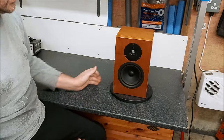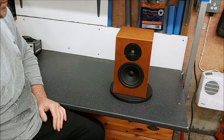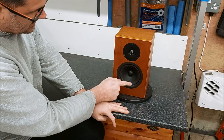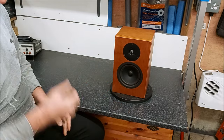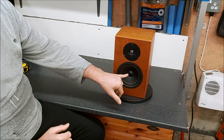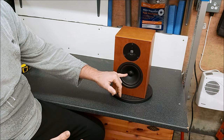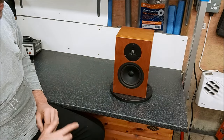This is the one with the tweeter issue — there's a big dent in it. You can see in the response we dip and peak and come down, and there's distortion there. Something's not right with the tweeter. Again with the woofer, this one isn't too bad; you can just see the dirt that's in there. Same issue with the dust cap — I'm hoping a bit of heat might reset that. It's almost risky disturbing this by getting the dust cap off to replace it when really it's doing nothing sonically.